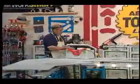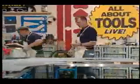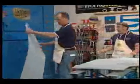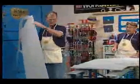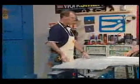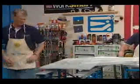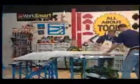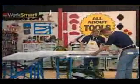Okay, let's go ahead. I have to walk all the way around our bench. Let's drop that off. We can go ahead and line this out. All right, so now we're going to take our template and actually mark the countertop. We'll mark it out because, since we seamed the section on, we'll line it up by our pencil lines on the front edge. So we'll get it right on our pencil line.